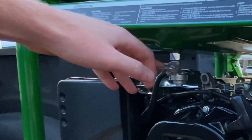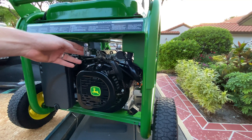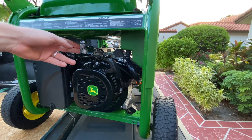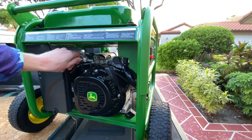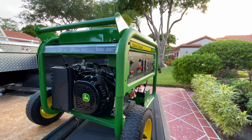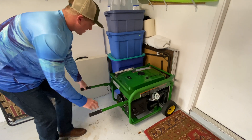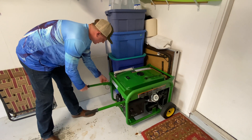You want to turn your fuel switch back down to the bottom, which is going to allow you to run the generator with the fuel that's in the tank. But once again I'll turn it back — and now the generator is ready for long-term storage. Nice and compact, so it makes for easy storage.